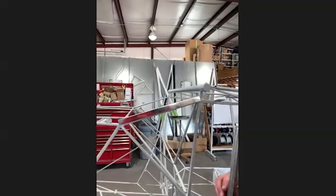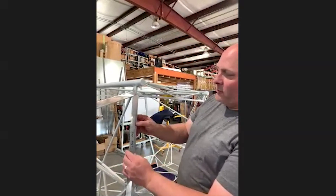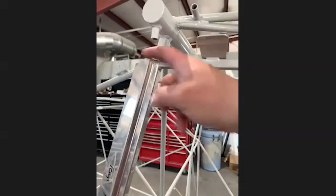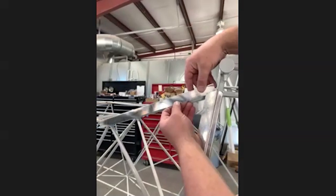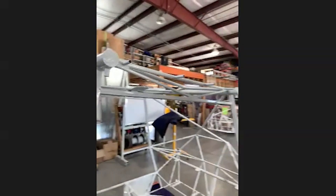You always want to clear the weld — that's one of the most important things. Make sure nothing is sitting up on a weld or resting on a weld, because that's going to change the geometry. I've already started shaping and trimming this vertical piece: I trimmed around the weld up at the top of the door frame and put just a little bit of an angle here, which happens to be the same angle this is going to intersect at. Those will end up overlapping once I clear those tabs and this can sit down.